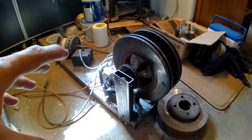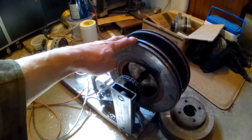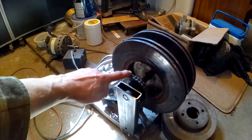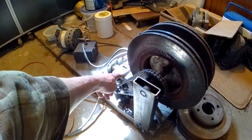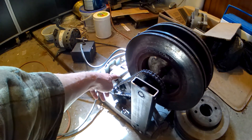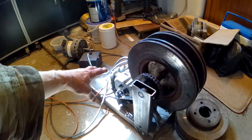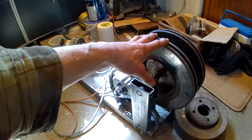Some of the issues that have come up is that I don't want to spin these too fast — around 1500 RPM is the limit. Right now I have a two-to-one ratio here, so when this gets up to about 3200–3300 RPM, this is starting to hit around 1500–1600 RPM, which is getting kind of scary. I'd have to build a cage around it. If I wanted a motor that went faster like 5000 RPM, this would be dangerous.